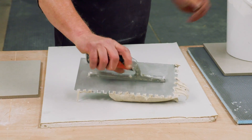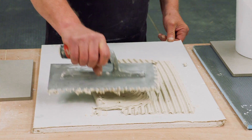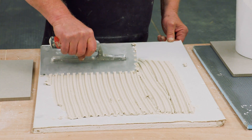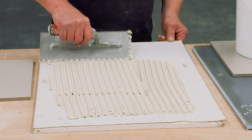A lot of people say you can never dot and dab — you must always use a notch trowel throughout — but it all depends on the substrate you're using. When applying tile adhesive with a notch trowel, it's important to do it in straight lines, because using swirls means air can get trapped in the adhesive and reduce the contact.